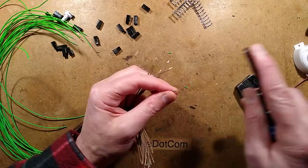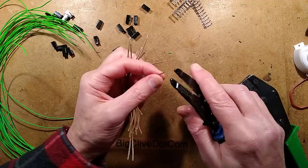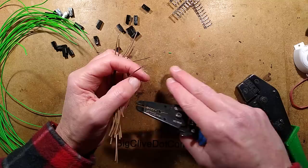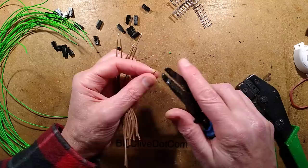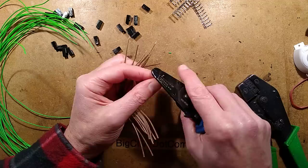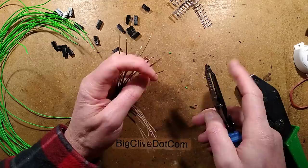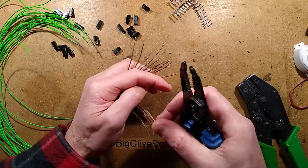Welding aluminium requires specific equipment because you really have to have a welder that can pulse and alternate the polarity on the tip of the welding rod. The oxide causes huge problems electrically by forming an insulation layer — aluminium oxide — and also a thermal barrier. That's why aluminium is so rugged: it's that oxide layer on the surface. When you change the polarity, it cleans the surface, then welds it, then cleans the next bit and welds as it goes along. If I get the workshop I'm looking for with more space, that will be an option.